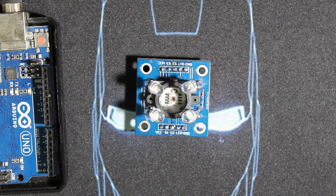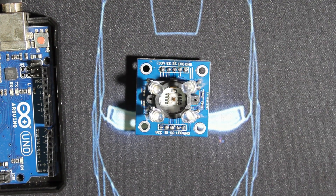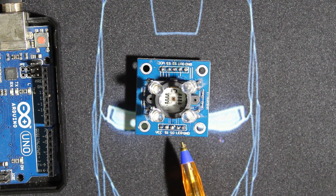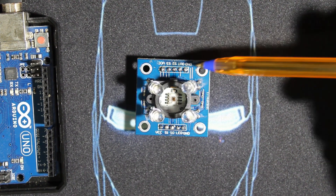Let's begin with the pins of the module. There are 10 pins in total, but VCC and ground are redundant so we are left with eight pins. VCC and ground will be powered from the Arduino using five volts. We have the LED pin — we will not use it, as the LEDs light automatically. If you don't want them on, you put the LED pin to low level, but I'll leave the LEDs always on. We also have the OUT pin.